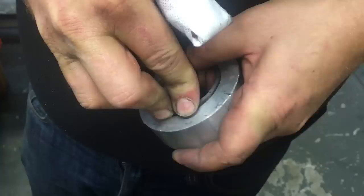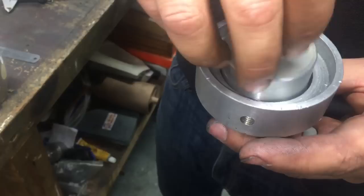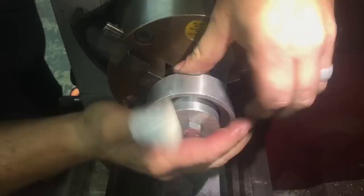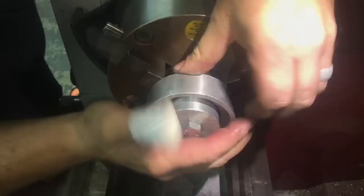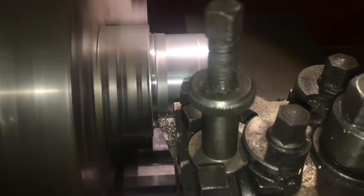Then into another bit of tooling - this time it's what we're calling the closure ring. Essentially it just squashes the ring down to the desired level of closure between the ends and holds it so that you can then put a mandrel in to bolt up and grip the ring. This is all so that you can then pop it back in the lathe to turn your final diameter. With it all bolted up the closure ring should just wiggle and press off the top - and then we can do the final process which is to machine off the external diameter to the desired finished diameter for the cylinder bore.